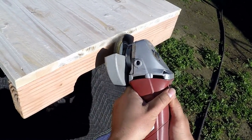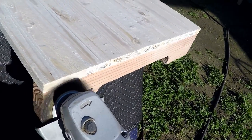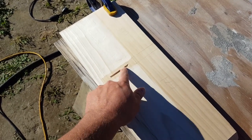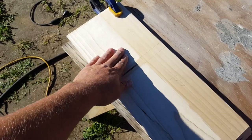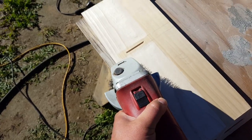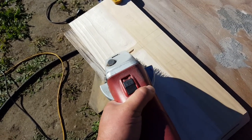One thing to note is I have created a little raised wood grain on plywood — it's not an awful lot, and you also have to be really careful not to sand through the top ply. You can see on this end piece here how I just drew out the areas that it's going to be glued to other pieces of wood. Like this piece is going to have a little biscuit joint there, so you just have to stay in the lines. I really like this angle grinder because you have so much control and you can go real slow — it's like a fancy little coloring book, only with a wire brush. You just stay in the little lines.